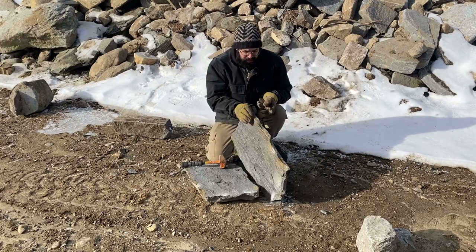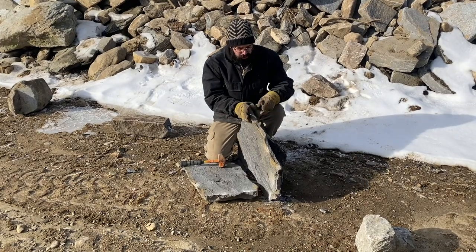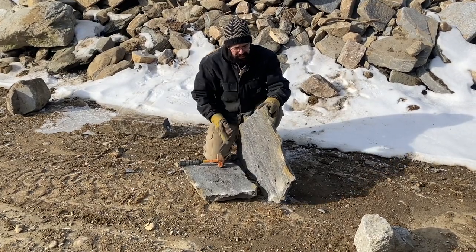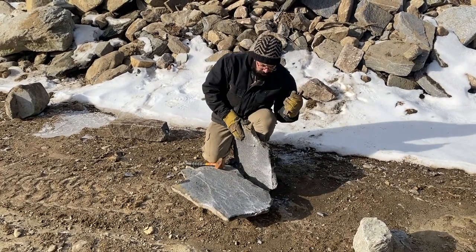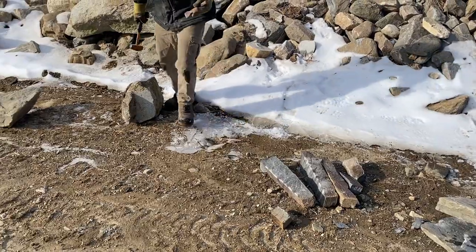In many applications a hammer like the stone busters would work fairly well with some stone, but if you're trying to split a thin slab like that of that size, those blunter angles are not going to allow you to split through. This chisel is a pretty specific use.